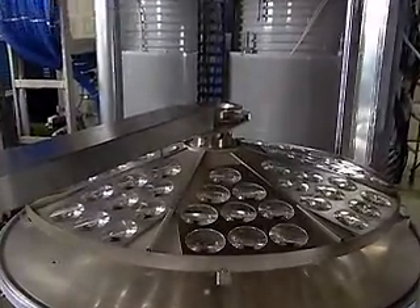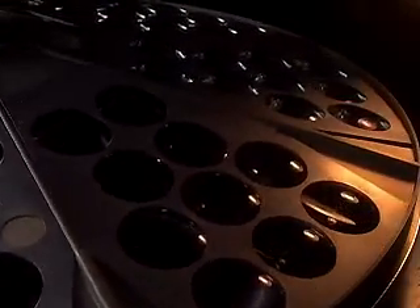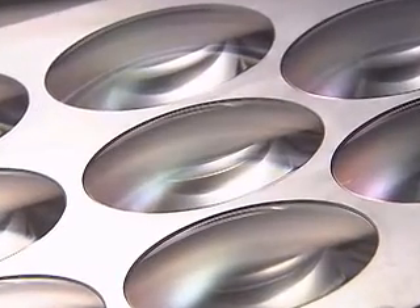To prevent light which passes through the lens reflecting back and to protect the surface, the lens is processed with a special coating of thin film. After receiving a thorough cleaning in the ultrasonic washing machine, the lens is placed into a vacuum evaporator where an evaporation substance is coated on the lens.